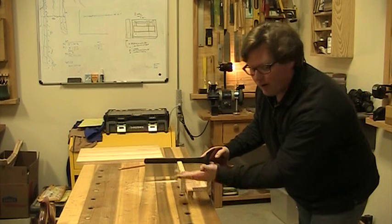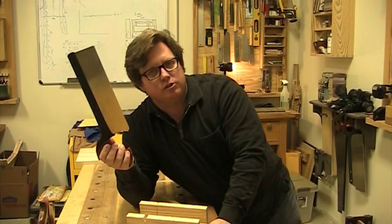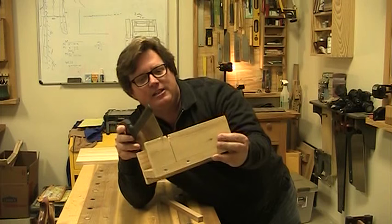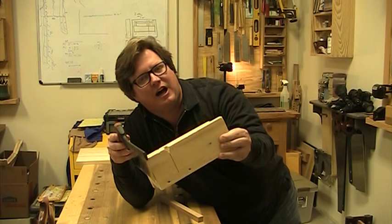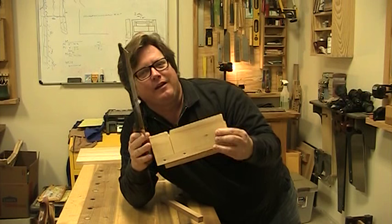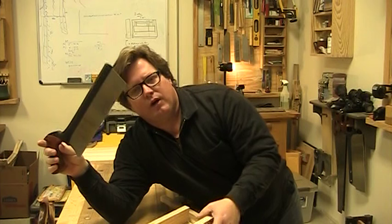Notice you want to be able to stop before you hit your workbench. When I design these miter boxes, I tend to design them for a specific saw. The reason why this particular box has a cutout is so the back of the saw hits that and acts as a stop. Most of my boxes are designed so when the saw hits the top, that's the base — which means the side boards are designed to be that distance plus the thickness of the wood.